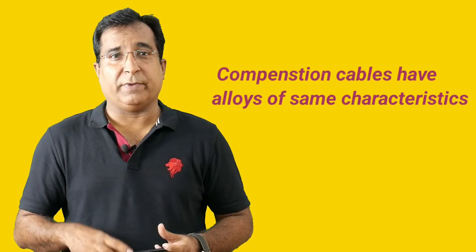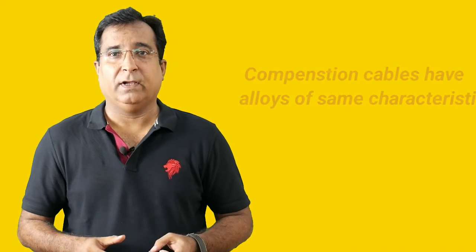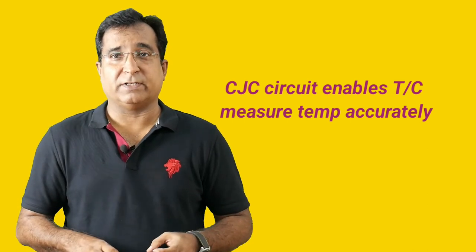Ideally, the compensating cable must be made of the same material as the thermocouple. But the thermocouple uses costly materials like platinum, nickel-chromium. Using the same material in compensating cable increases the system cost. But if we use any other material cable, the measurement would be falsified due to unwanted additional thermal voltages of dissimilar metals. So we choose an alloy of metal for the compensating cable whose thermoelectric characteristics are the same type as that of the corresponding thermocouple. These cables behave the same way as thermocouple wire does. The head-mounted transmitter has fully avoided the need for compensating cable, but must be chosen to fit in the given space of the terminal head.